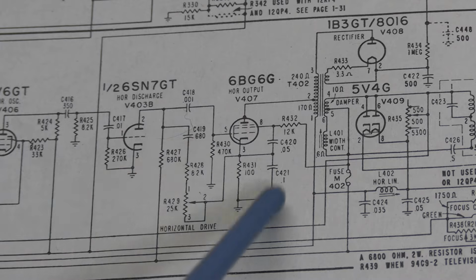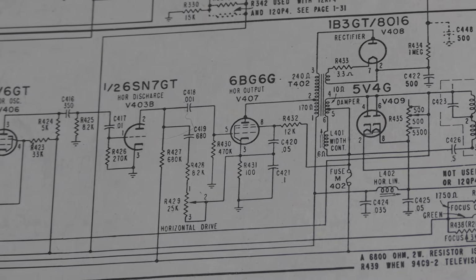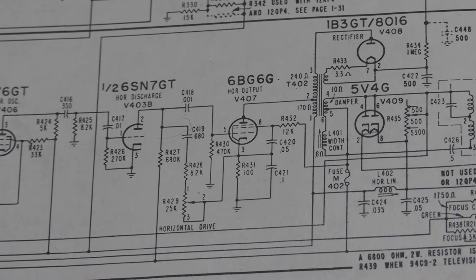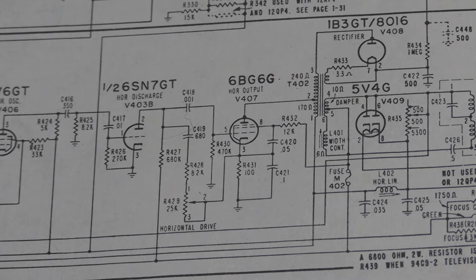And just in general, not only do I want to use parts that are on spec but are robust, so I may even increase the wattage rating, that kind of thing. I use metal film resistors. Yeah, they have some parasitic capacitance and inductance. For frequencies this low, it's not an issue. I was just reading a data sheet, and it's fine until you're above 100 megahertz. You really don't need to be concerned about using metal film resistors, so that's what I use.